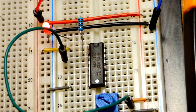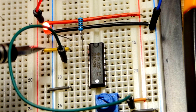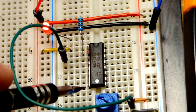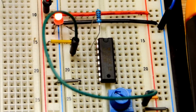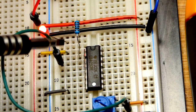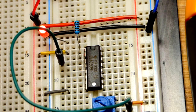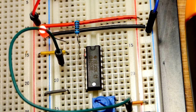This is a very simple circuit - it's a hex buffer IC, meaning there are six buffers. We're only using one. There are two pins to power it: pin 1 goes to the positive rail and pin 8 to the negative rail. The pins we're using are 2 and 3 - that's one of the buffers. The resistor and LED are the output load, and pin 3 is the input.